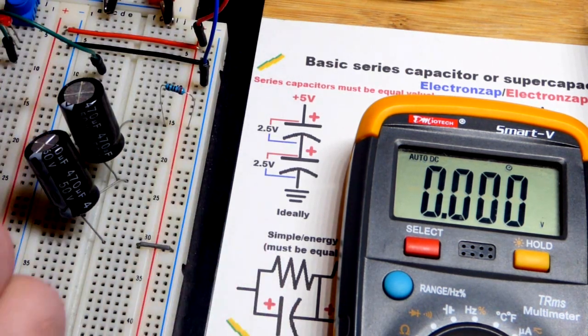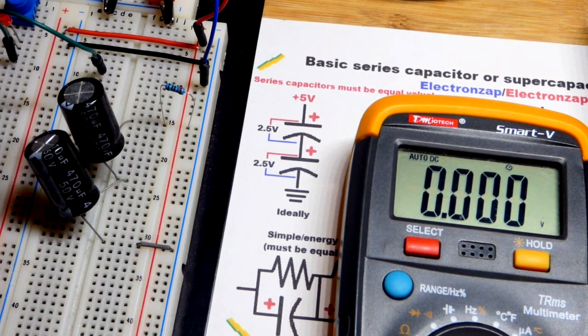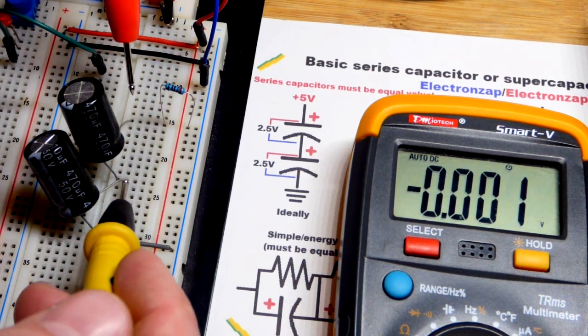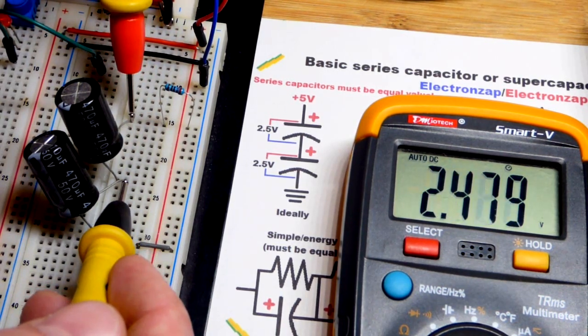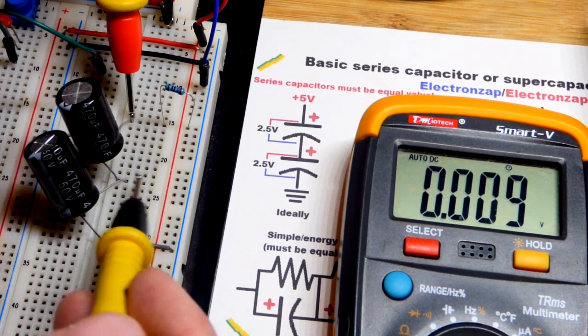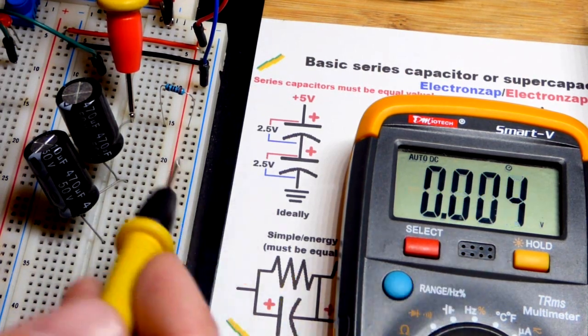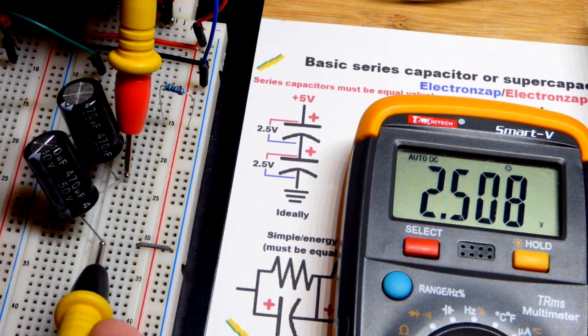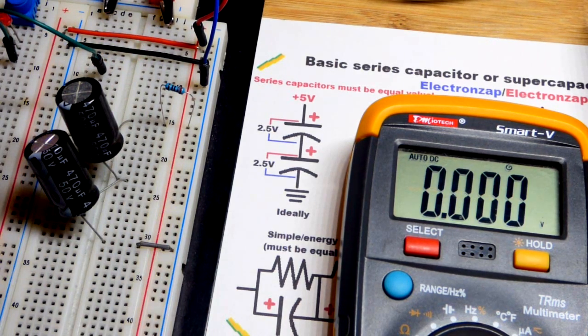Now I'm going to try to pluck both of these resistors at the same time. If I had just pulled one, then we would have quickly had them unbalanced. But there you can see we get about 2.5 there — I bet this one's a little bit lower. And there it is, it's a little bit lower. So they're not balanced right now. Also, while I hold the probes here, you may see the voltage going down — that's because I'm actually discharging this capacitor through the meter. There's a lot of resistance in the meter, so it's very, very slow, but it is indeed discharging.